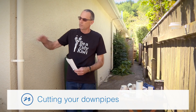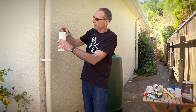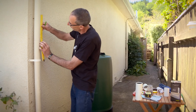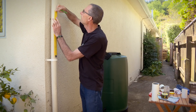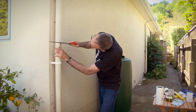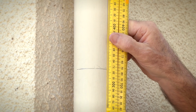The next stage is making the cut to fit our diverter in there. Now if it was an 80mm downpipe it's very easy — you just stick the sticker on and cut it to the dotted lines. But because we've got the adapter pieces and extra lengths of pipe, we need to allow for that. I've measured that and I know that I need to go to 325mm. So I'm just going to mark that on the downpipe here. And now we do the cut. An old builder's adage: measure twice and cut once. So we'll just check that we've got that right.